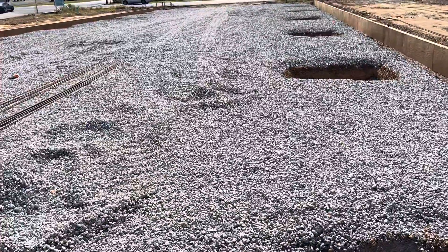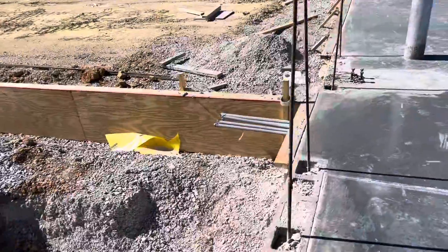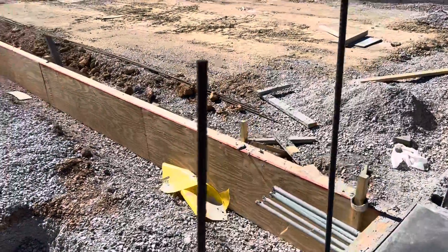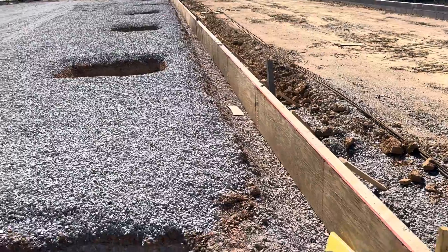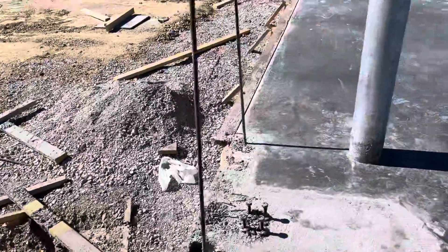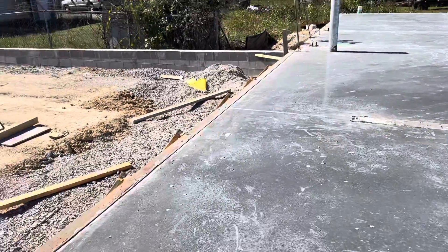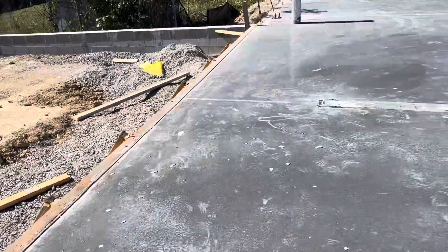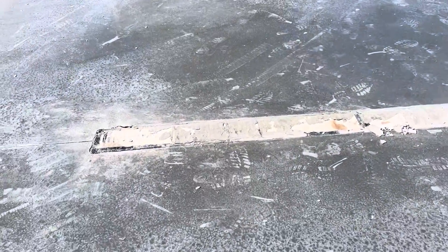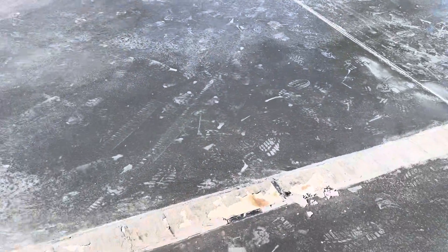Put the stone to grade, and that will be like a turn-down slab. You can see here — turn-down slab, 2-foot turn-down slab. And here, that is the steel bollard. Here we have an overhead garage door, and here you can see the trench drain for plumbing — it will be in the slab.